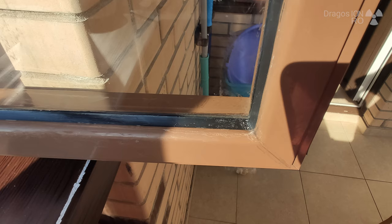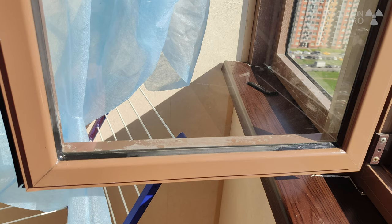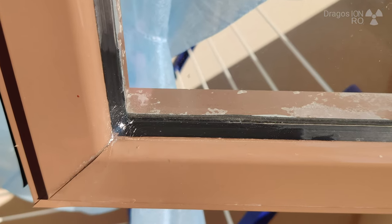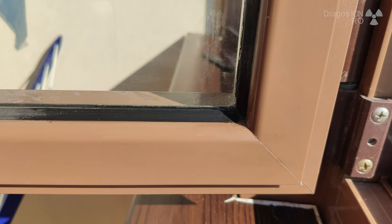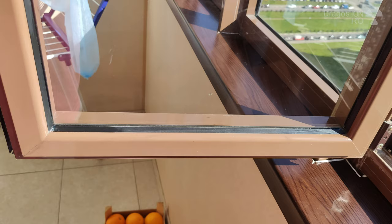You should remove the tape as soon as you put the silicone — you shouldn't let it sit there too long so it doesn't get dry. Then don't touch it for at least the whole day, 24 hours. Sometimes aluminum windows have spacing between them in the corners, and you can put the silicone there also.